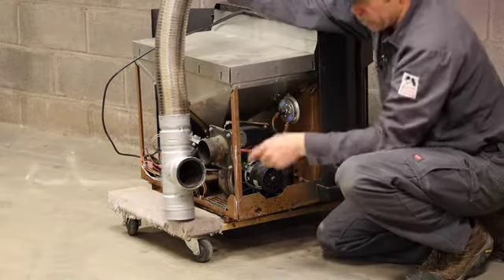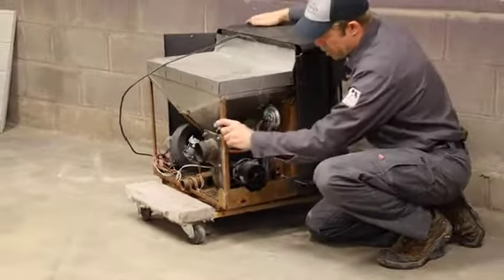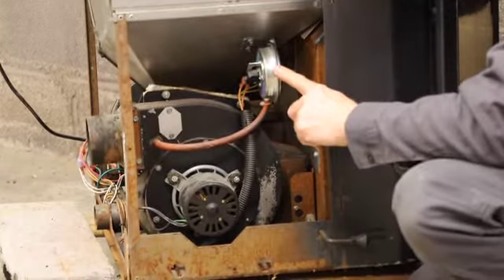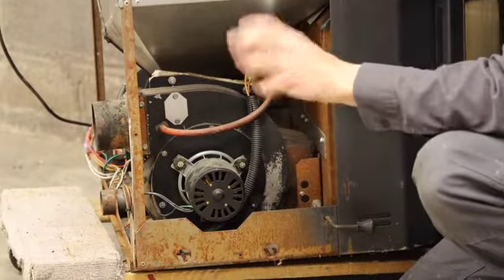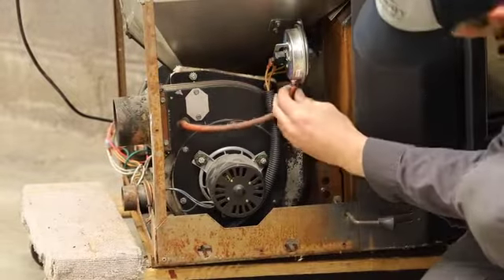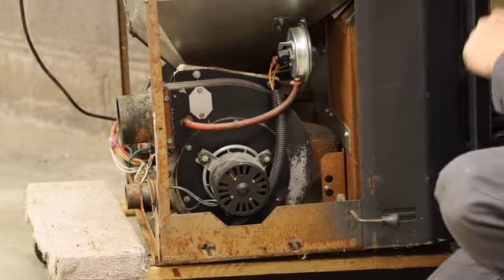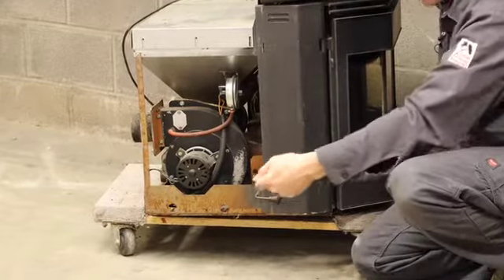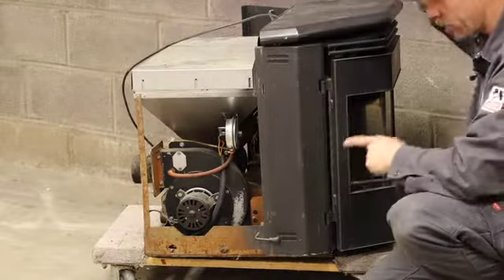A lot of the Quadrafire units come with a top exhaust, so instead of horizontal they have a vertical, which makes it a lot easier, and they have a built-in ashtrap. This red tube is going to the vacuum switch — an electronic switch which senses the amount of pressure being developed going out the exhaust. If there's too much back pressure, the vacuum switch cannot close and therefore it shuts power off to the auger motor. Every once in a while you'll need to blow through the tube to clear a piece of debris. Don't blow into the vacuum switch itself — it's a very sensitive diaphragm. The older models had a damper rod here; to the left is usually open, and it's basically a shutter that will shut or open the exhaust to regulate what the fire looks like on the inside.